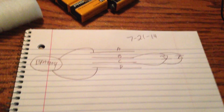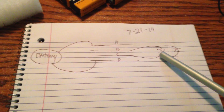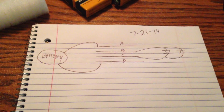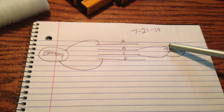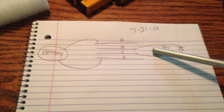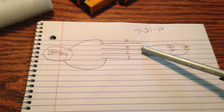I was lighting two LEDs. Each LED was actually in opposite direction, so it could show me which way the current was flowing. So when I charged it, one of the LEDs lit up. When I discharged it, the other LED lit up. You can see how I got the battery connected to the outer plates, and the LEDs are connected to the inner plates.